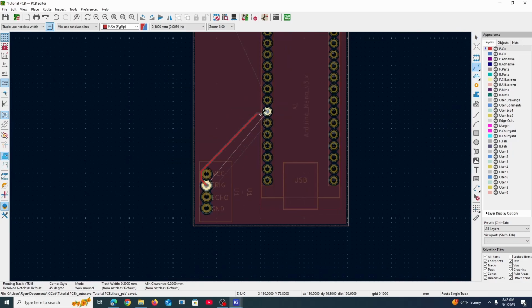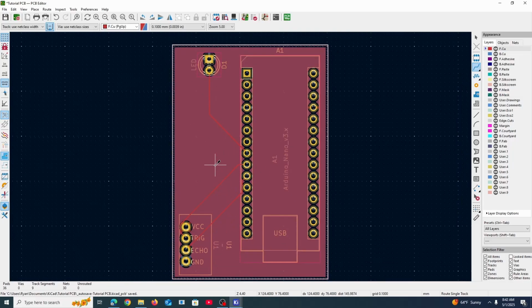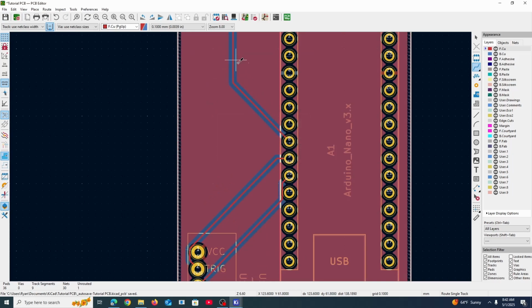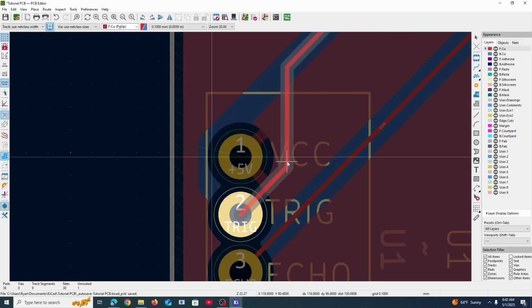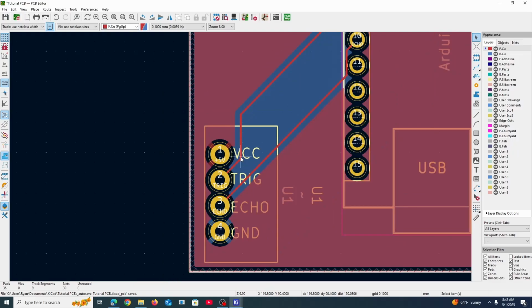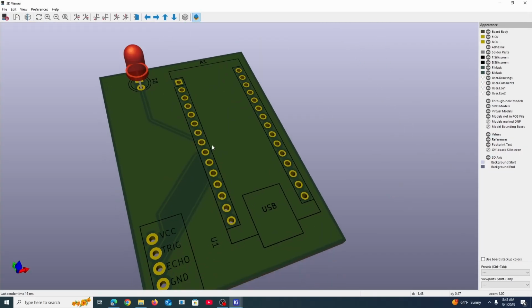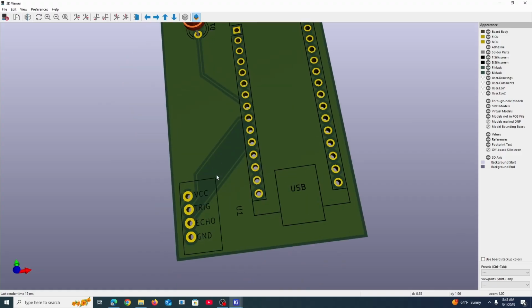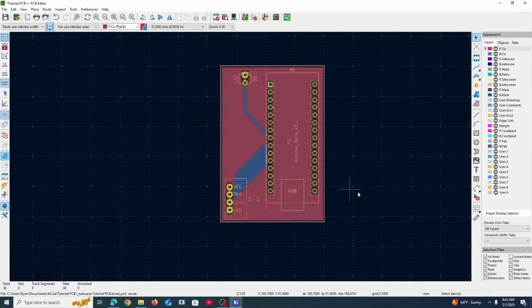And now that means we only need to connect the non-power signals. And it's literally just 3 individual wires. And we press B again so that it can make space for those wires. It's now showing a wire or like a connection that needs to be made here because we've kind of blocked it out. So I'm gonna click and drag that over here and hopefully we're good. Okay. So if we go here, we can kind of see how now, before it used to be plain, but now we see an actual like PCB trace. And yeah, that's basically how you would make a PCB.